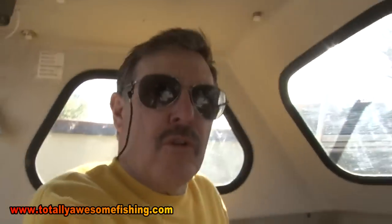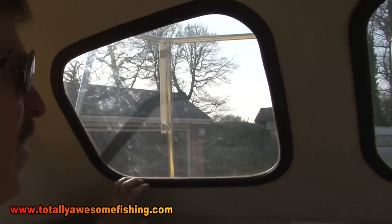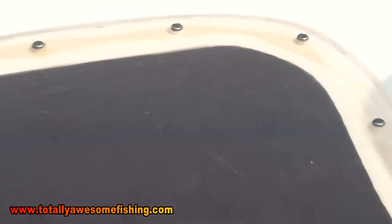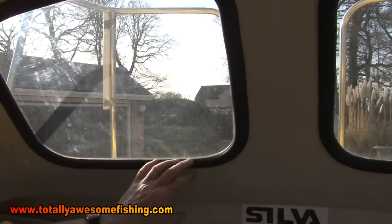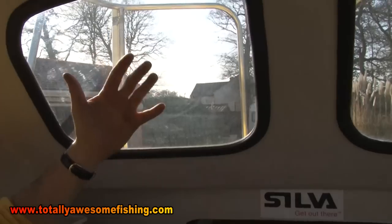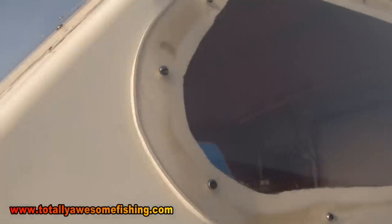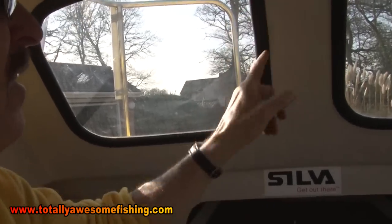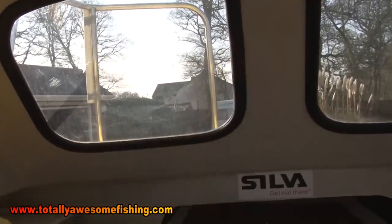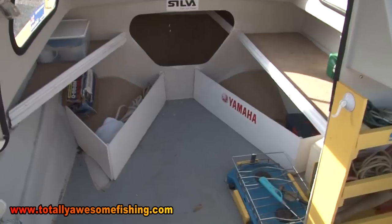Now I'm doing a really good sell on this boat, and I have absolutely nothing whatsoever to do with this company. But the downsides, other than the fact they slam, are just these cheap plastic windows and the cheapo rubber seals. Wayne aboard Tara has got rid of these - he's got stainless steel bolted-in acrylic, a rigid piece of acrylic that firms everything up and doesn't leak because it's sealed. That's something worth looking at. I've had no trouble with mine at all, but the boat's only about three years old. Don't clean them with a scourer - just wash them with soft water and a soft cloth to keep the salt off.